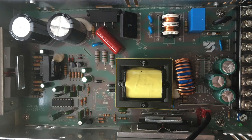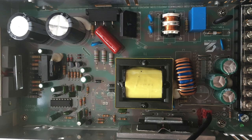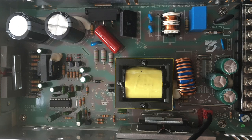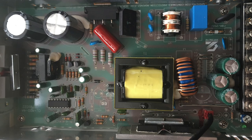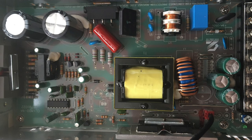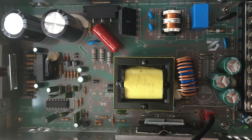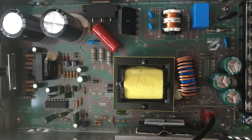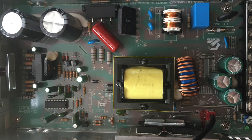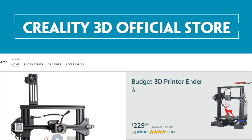The Breadboards channel mentioned that the plastic shield underneath the case, between the case and the PCB, was pinched on the standoff so the PCB wasn't making good contact. A viewer named Plasma found problems with the actual physical wiring harness going from the output jack for the AC to the power supply itself — it was coming loose. So it could be any number of things. That last one would be a Creality issue; the others are a power supply issue. Again, this can happen with any power supply, so always check your grounds.